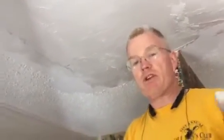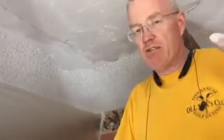I think we'll end it on step 2 of this process so that you understand how to fill in a whip. It's called a whip when the sheetrock goes in between 2 studs. In this case, the joists are 24 inches apart from each other on center. If they don't use 5/8 sheetrock, sometimes this happens to be 1/2 inch sheetrock. There's a little play in between 24 inches, and that's what I'm attributing this whip to.